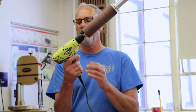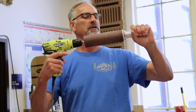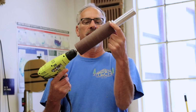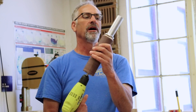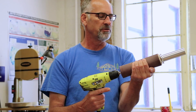And the bladder sander, we hook it up to a power drill. It has a bearing on this side, so we hold on to it on this side, and the bladder will spin. We call it a bladder because this is a rubber bladder full of air, and we have a sanding sleeve over the top of that. And there's a valve right on the inside here. We just pump that up to just firm, right?